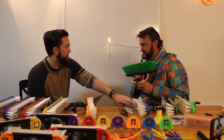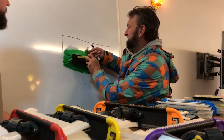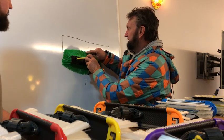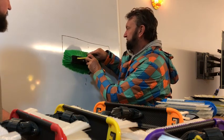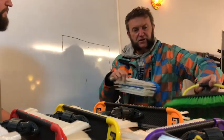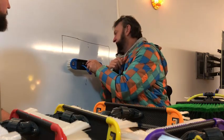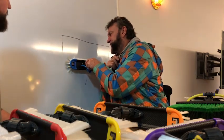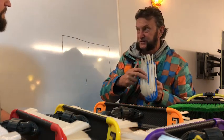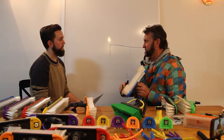Yes. Basically when this brush compresses, the sides of the bristles on the underside are on the glass, not the tips, right? So here, all of these bristles are lying on top of the bottom bristles, and so the brush is splaying like that. Whereas Constructor is a triple trim brush, and no matter how hard you press it, you can't get it to compress any further than the inside trim, because it's a really rigid bristle, which compels the bristle tips to stay on the glass.